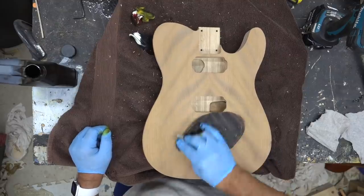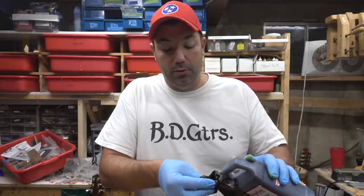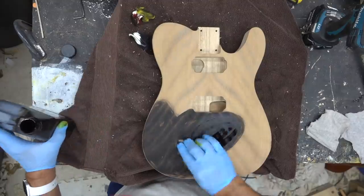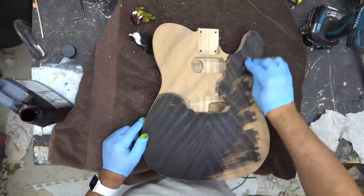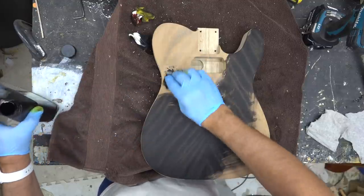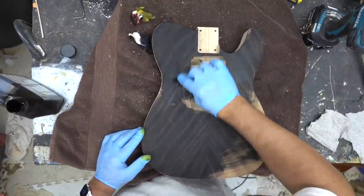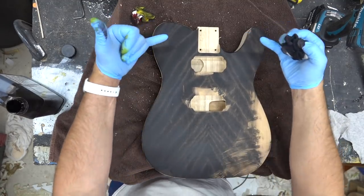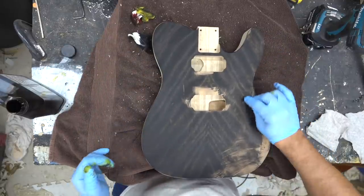We're using Angelus leather dyes today - I've got the link below where you can purchase these. We'll put a nice thick coat of black on here; this was sanded down to 320. What I noticed last time I used roasted wood is that this stuff really soaks up the dye. I probably should have diluted it, but we're going with it. I can always take this back upstairs to the drum sander if needed. The problem is there isn't a lot of figure on the sides, so I needed to do something to cover them up.